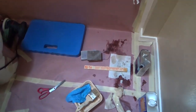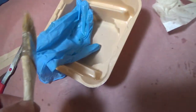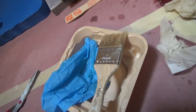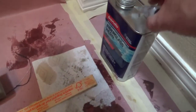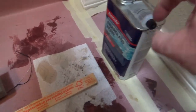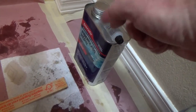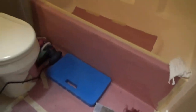She'll get her orbital sander out and start sanding more, then decide if she needs more resin. If so, she'll take her resin material, pour it in a little plastic container she got at Home Depot. She's got plastic gloves, a throwaway paint brush, paper towels. You put a little bit of resin in there, then 10 drops of the hardener to one ounce of resin, mix it with a paint stick, and away she goes. I told her to wait while I put the craft paper down.